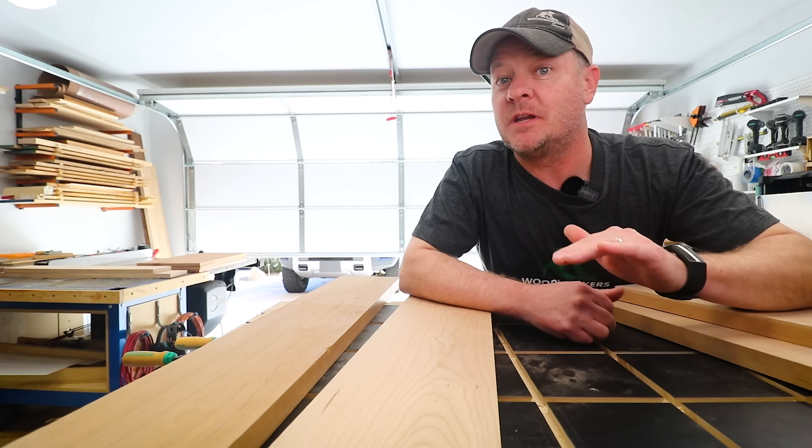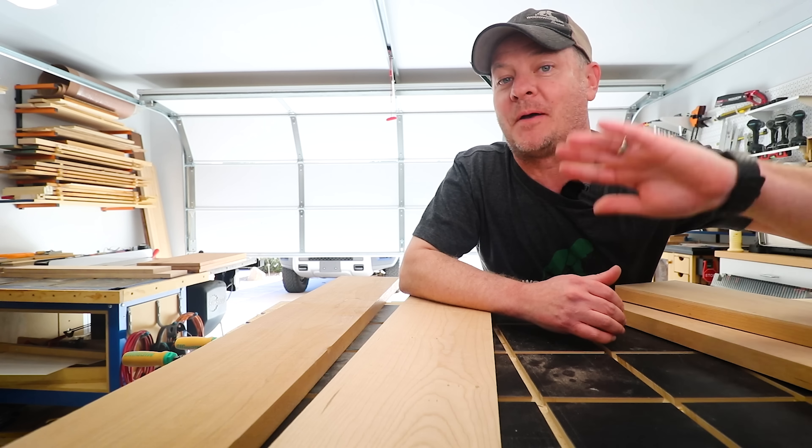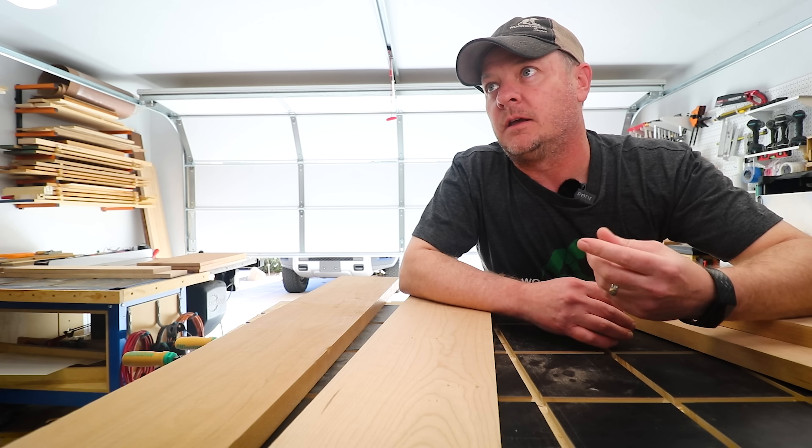You don't need to be too extreme about giving your cherry boards a whole lot of light. You don't need to put them up on the roof or anything like that. All they need is just some ambient light. In fact, if you put them in direct sun, you really risk bleaching out the wood a little bit. So I wouldn't do that — all it needs is just ambient light.